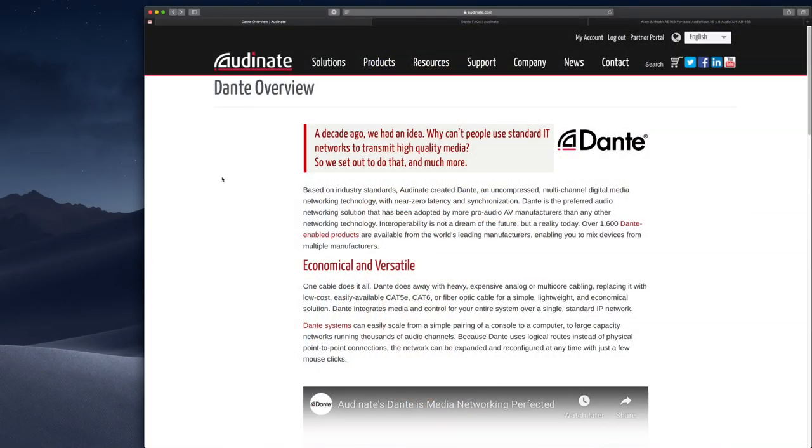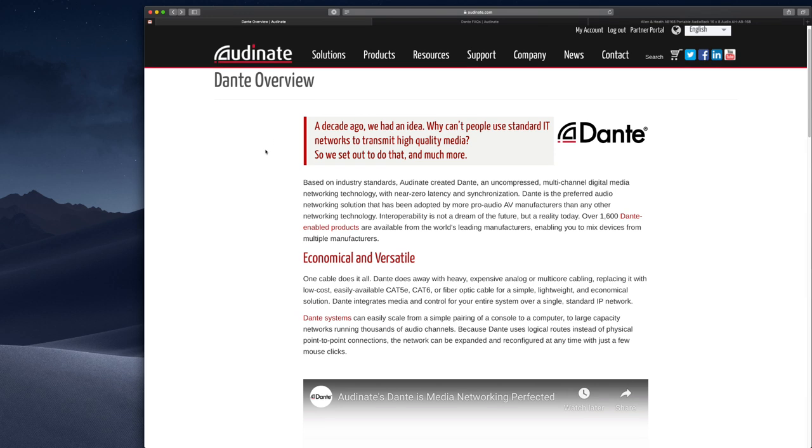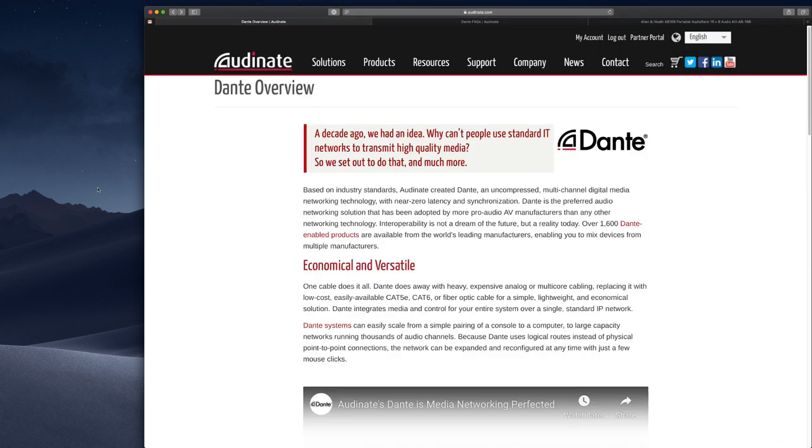So let me just show you a couple things here. I'm going to switch back over to the Audinate website. Audinate's the company that put together Dante, which is basically an audio network protocol, and it allows you over a single Cat 5 or Cat 6 cable to run multiple channels of digital audio between any devices that are also connected to that Dante network. Let me just switch over here to give you an example of one.